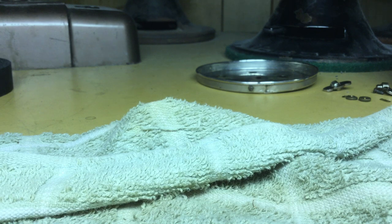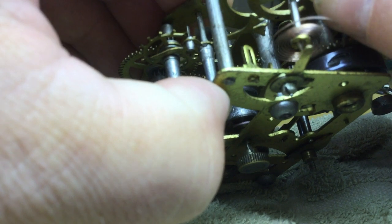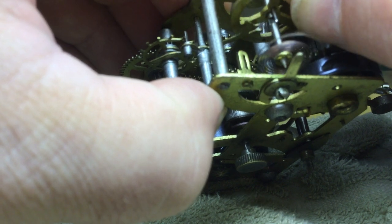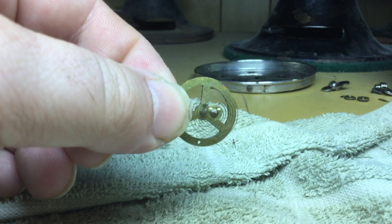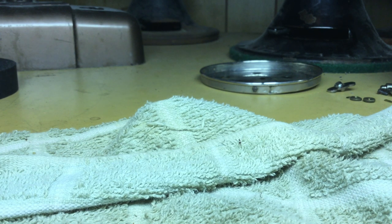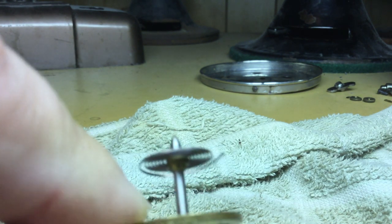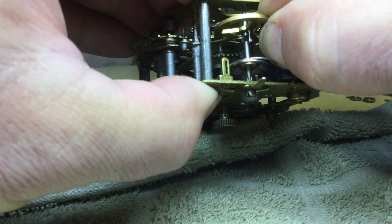Get it back in about the right position — I've done that off camera. It still needs to go in a little further and you can use the movement there to determine if you have it in the right spot. At this point I'm not paying attention to the end of the hairspring relative to the impulse pin — that will come in a moment. I am just trying to get the hairspring back onto the balance wheel in the right spot, and that looks about right — looks like it's going to be about centered.